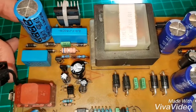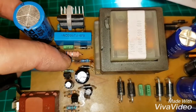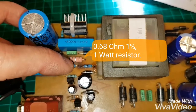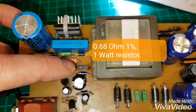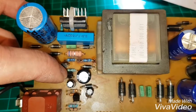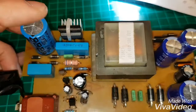Then I put it all back together and it went bang. This resistor here blew up, and I couldn't figure out what it was because all the code had blown off it. It's a 0.68 ohm metal oxide resistor — I've put a 1 watt in there, and 0.6 watt versions of these. Incidentally, these resistors are the same as that one — 47 ohm and 0.68 ohm.